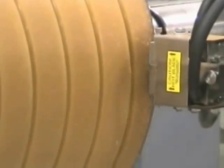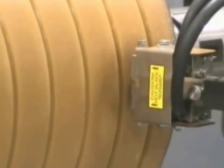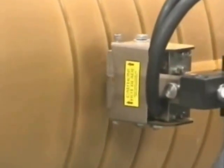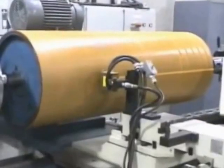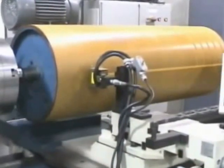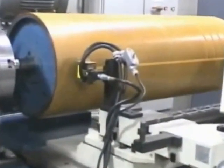As with roughing, the grooving operation is quick and free of dust and smoke. Here the blade is traversing at 100 inches per minute and the groove is ½ an inch wide and about ½ an inch deep. This grooving speed and cutting quality is unachievable through a conventional grinding process.